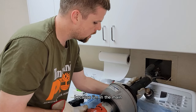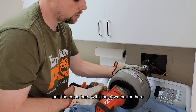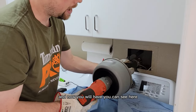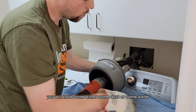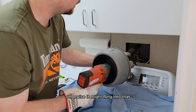I'm going to slowly pull the cable back using the down button while still in the forward direction, and this is going to retract the cable. You will have some dust or water coming out of the drum — just don't put your eyes right here or it might fling into them.